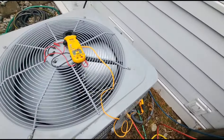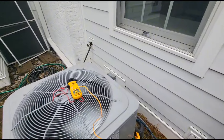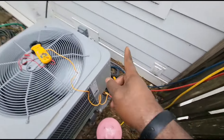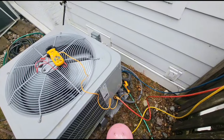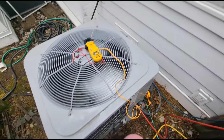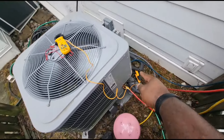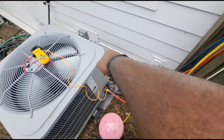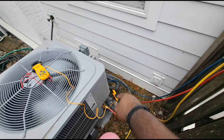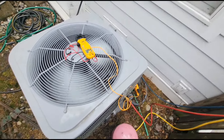On this unit, remember it does technically the third floor and one or two rooms on the second floor. The third floor room temperature was at 74 and the second floor was at 72, so the customer had the third floor off. That's probably why my superheat is a little hot — that third floor wasn't really that comfortable out there. Maybe the customer doesn't run that third floor as often. But I'm glad I was able to locate this issue and most importantly I'm glad I didn't have to deal with that drywall downstairs. Every leak check is different, but the two biggest things you can take from this video: one, you've got to be patient.